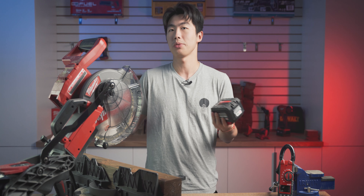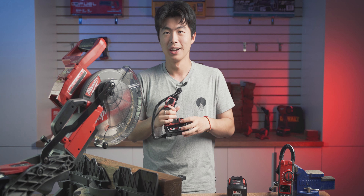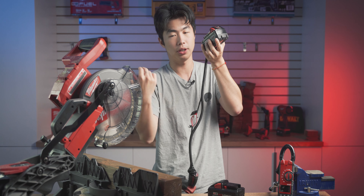I can charge it up right after the test — it's pretty much designed for the miter saw. Some of you might wonder how much current the miter saw actually pulls. This can be hard to get because Milwaukee never discloses that information — they never tell you how much current the tool actually needs, and it also varies by job. So because we have an amazing service department, we figured out a way to measure it ourselves. We basically took an empty M18 battery shell and put it on a tool handle so we can connect it to any tool we want, then connect the other end to any battery, with cables between all the connections to measure the current pull.